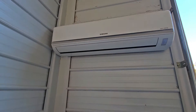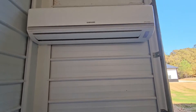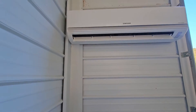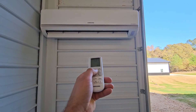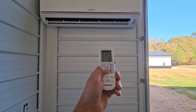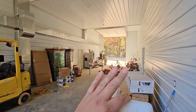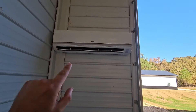One thing you want to know about this three-ton mini split is there's a horizontal vane that you can oscillate. I definitely recommend putting it at about 90 degrees so it doesn't hit an obstruction and cause a bounce-back effect. You can push the oscillating button to stop it. If the vane is set all the way down to blow toward the ground, it may hit the floor and may not get the air all the way to the other end. This shop is about 60 feet, but this model can blow about 40 feet.